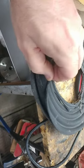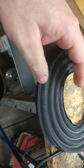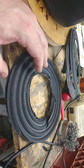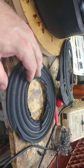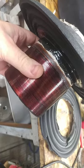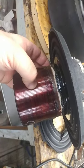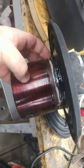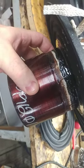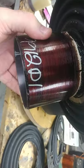I've had to harvest the coils by grinding off the old adhesive — they used CA mostly because it's cheaper and faster than epoxy. This was their top spider and this was their bottom spider. The top spider was a two-layer type, just laminated together. Now there's a huge perception problem: some reconers rate the coil in power, which is dumb, because all coils are rated thermally. This one's rated to probably around 500°F, and we'll actually do like 1000°F before it actually melts — aluminum melts at 1200°F.